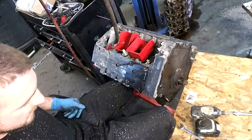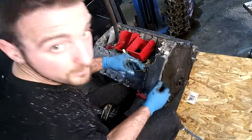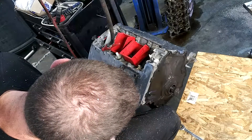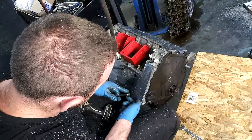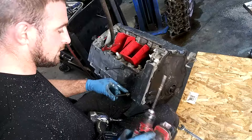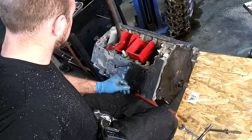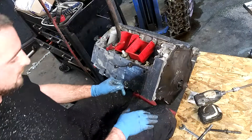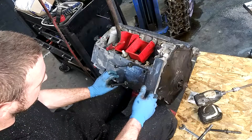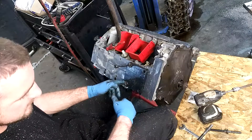I'll take one of these bolts and just visually note the space between the plate and the washer — it's on the first thread. Just make sure they're relatively the same, and that's to verify that the insert didn't back out when removing the installer, to make sure it's fully seated. That is one of 20 inserts, so it's definitely a time-consuming process. I tape the deck up here with duct tape just to make sure there are no metal shavings going into the engine. Missing a piece of tape here — should have put one there.